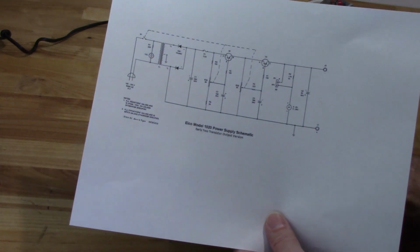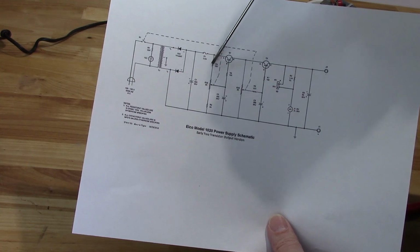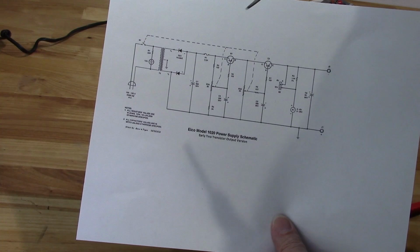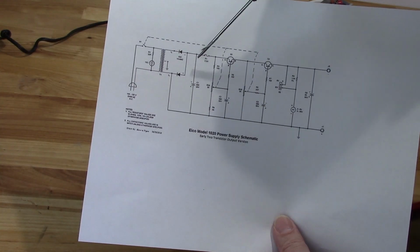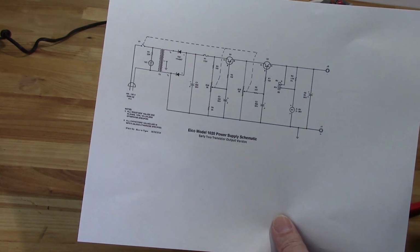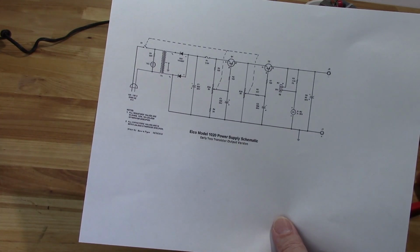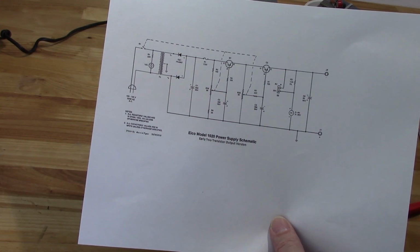You know, I've just come to the realization that all these resistors are missing. There's no resistor here, here. These two are gone. That one's still there, and that one's still there. Those are the only two resistors. This one here is missing. So I have to replace every one of those resistors as well. And the caps are actually wired backwards, which makes sense because we're dealing with a different transistor. So whatever they did to rewire this is really a dramatic departure from the original schematic. So I'm going to basically have to unsolder everything and almost start from scratch.